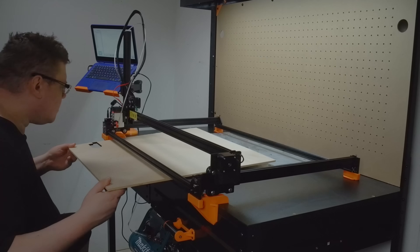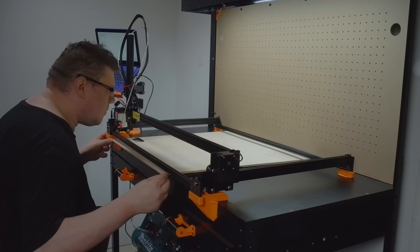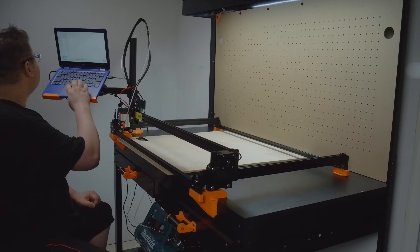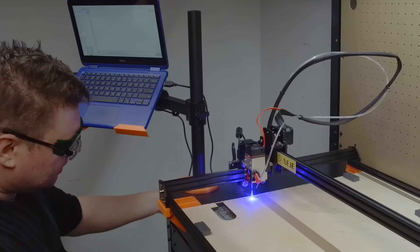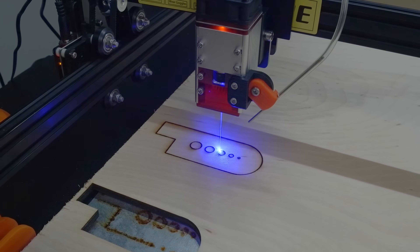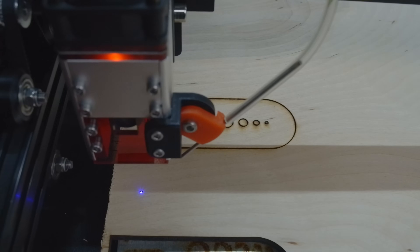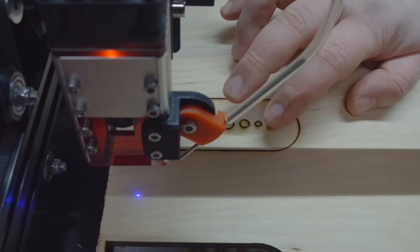The gantry is held in place and elevated, allowing for oversized sheets to pass under the frame. Here's the birch ply from earlier, and here's a repeat of that last test cut, except now without the air assist. Needless to say, while I didn't encounter any flare-ups, the smoke released during the first couple of passes left a heavy coat of residue along the cut line. What's more, even after 6 passes nothing seemed ready to budge, already positioning the air assist method as the obvious winner.